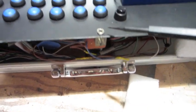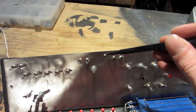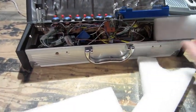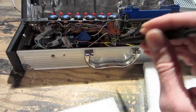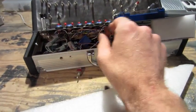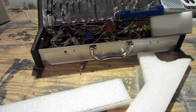So I ended up installing my input here, since there was already previously a case hole on that side. I just widened the hole there. However, I found it is sharing the ground and not actually switching both wires. So I'm going to be adding a toggle here, yet another toggle, to switch the sound, so I can input the stylophone there.